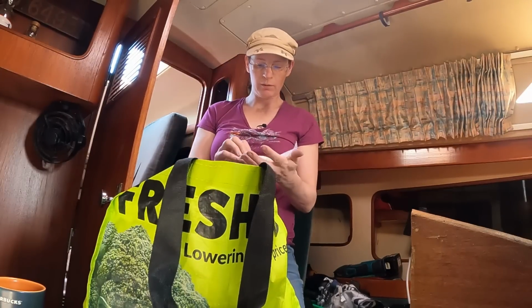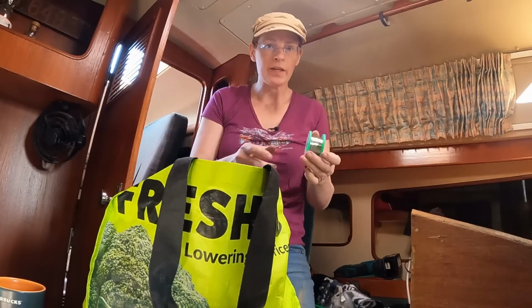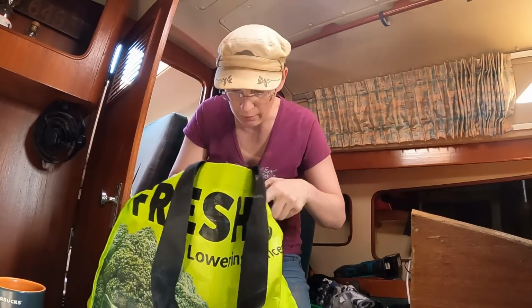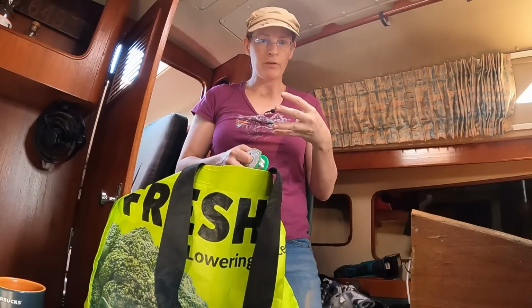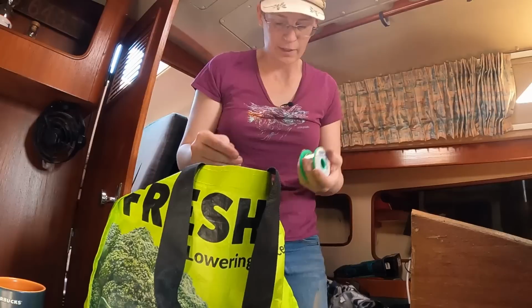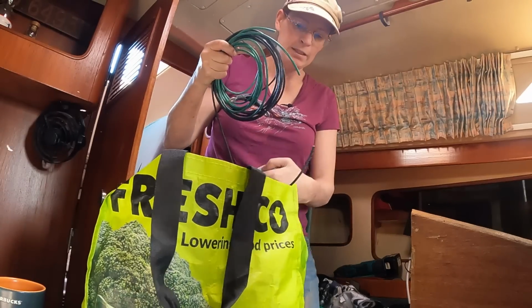What I might do... You know, another option I could do for the trip home, please don't hate me for this, is I could just tin the stranded wire and then crunch that in. It's very much not the way you're supposed to do it. You know what, I could use the proper Ferrules for the shore power coming in and then just tin the other 3. I really don't like doing that, but desperate times, you know.